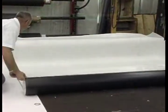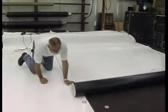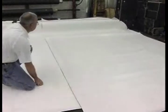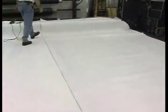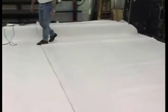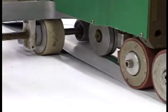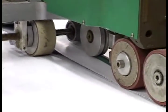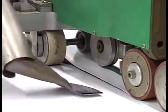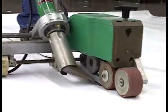Step 3. In the field of the roof, position the Weatherbond Pro-TPO membrane over the substrate, whether using 8, 10, or 12-foot rolls. When encountering penetrations, cut the membrane to fit as tight as possible around the units. Utilizing the pre-printed X markings along one edge of the sheet, install all of the required fasteners. The HPWX fasteners and HPWX plates are required for membrane securement. Lap splices are set at a minimum of 2 inches to achieve a minimum 1 and a half inch weld. No mechanical securement is required at this location. The sheets are typically fastened a maximum of 12 inches on-center — this project requires 12-inch on-center fastening for field sheets. After the sheet has been fastened in place, position the next roll of membrane overlapping the adjoining sheet at least 5 and a half inches.